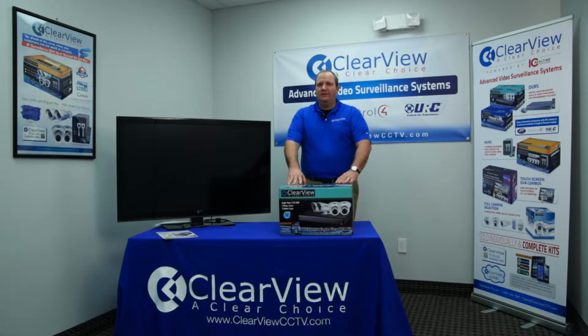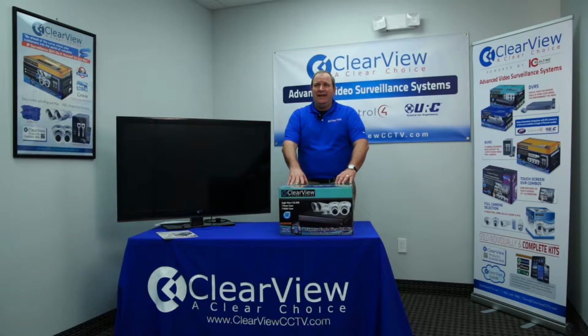First I want to talk about some of the differences between the two. The Eagle is designed primarily as a commercial grade and heavy residential grade unit. The Hawk is designed more for light residential and light commercial applications. When you get to things like integration with, for example, RTI or Universal Remote or Control4, you will want to definitely use the Eagle unit. It's capable of doing 30 frames per second at D1 resolution. It's capable of supporting multiple hard drives as well as other features that will definitely make it a stronger choice for you for high-end jobs.